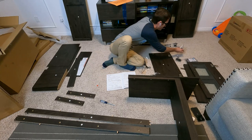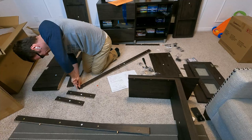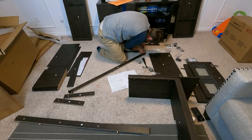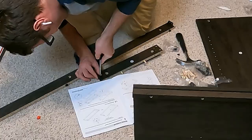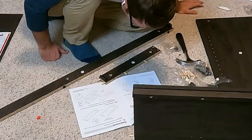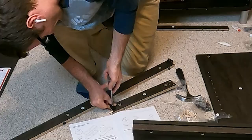Once you've glued each dowel in place halfway through, then you're going to be putting them together with this weird screw and hinge array. It is not easy. Take your time here and make sure that you use a screwdriver that has a long enough bit, because it's a very, very narrow connection. As you can see, I'm connecting the side pieces first on these small little pieces, which is easiest, and then I'm going to be attaching the long pieces simply by these tiny little screws.